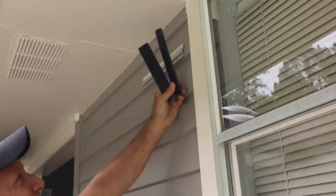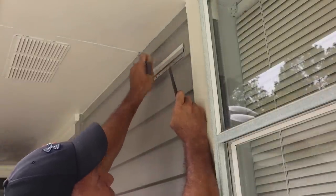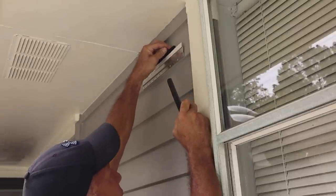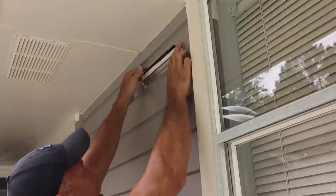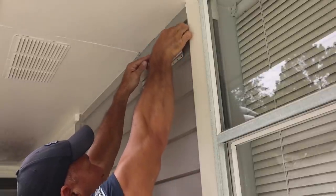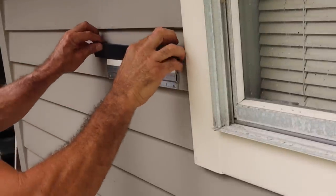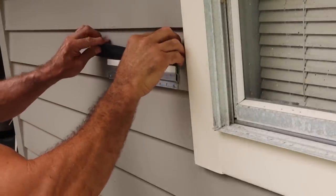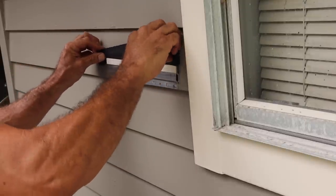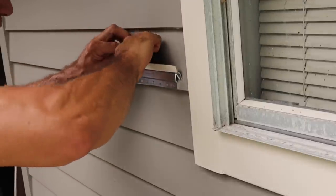I need this to be tight coming forward — I can't have it pushing back for any reason. So I'm going to take this little shim and put it behind the cleat so it forces it forward. Make sure that they're tight; that's why I have one go in one way and the other go the other way — it forces it forward. Same thing right here with shims; I'll put them against each other right in the track and push them together until they really force it forward.